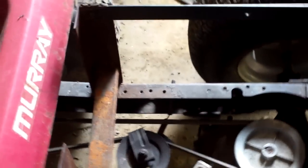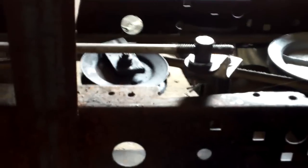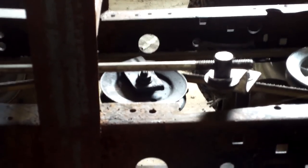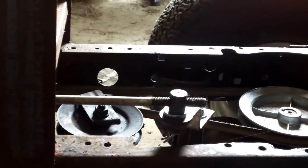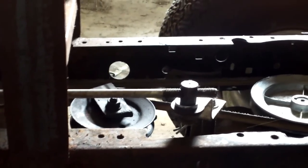It has two 5-inch pulleys on the back. And on the front, it has a 5-inch pulley as well, so it's all a 1-to-1. I've got a double pulley situated. I don't know if you can see it. Maybe you can. Right there. And it works really well. I do not have any Kevlar belts on these. These are just regular automotive belts. But so far, the tensioners that I have do fantastic.